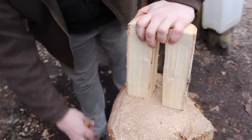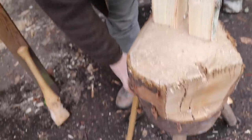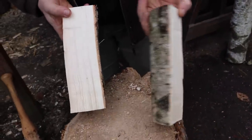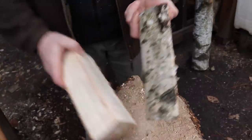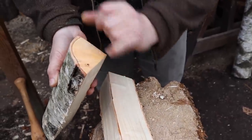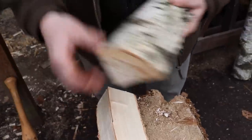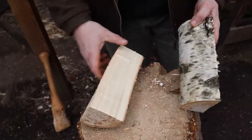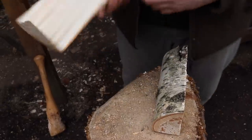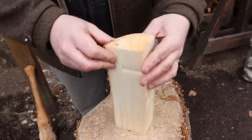The froe is a fairly blunt tool, so it can be put on the ground — I wouldn't do that with an axe. This section looks fairly straight. We've got an inclusion here — a fissure in the bark where the tree's been damaged with added growth on top, so there'll be a weak spot there. We've got knots here too — you can see the waves in the wood. I'll use that piece for a spoon or two in future. This is the piece we'll be using.